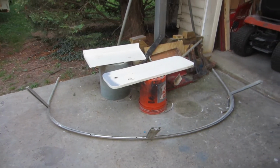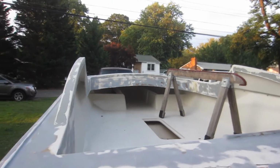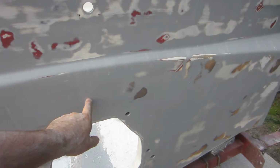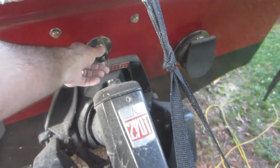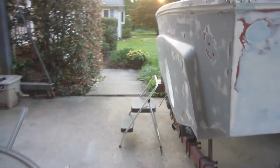I've thought about this for a while. Yeah, it's a new plan, but we got to make sure it fits. And along with that, I have vents, a cleat, another vent, a bilge pump vent for the gas tank, input, freshwater input. Yeah, this thing's gonna be fancy. On all my boats, I do this now. I have this little freshwater input. You just plug the hose into that, start your motor, flush it out, unplug your hose. It's a really nice feature.